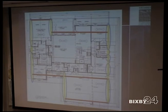What if I just skip that wall and take this brace wall line out, and just combine the very last one, which is the master bedroom wall, with the dinette and second bedroom walls together, and have another brace wall line? If the calculation shows that that's okay, and since they are not over 60 feet apart. So you're talking about combining this wall with this wall, and then just have this one on its own?